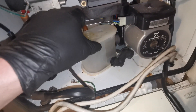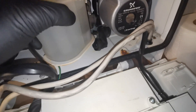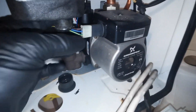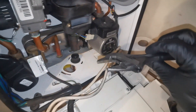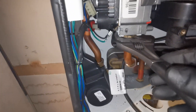Make the appliance safe — you all know how to do that. Sump cover off, flue duct out. Then you want to take out the condense trap, disconnect the pump plug, and remove the gas valve.